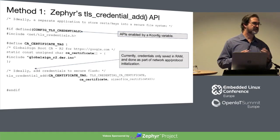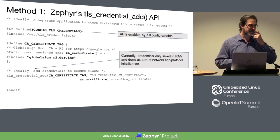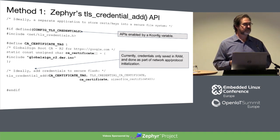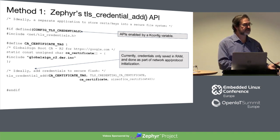Yeah. So that's a common concern, especially in the Linux community, for having this kind of offload in a mainline operating system like Linux. It's the same concern here, as you mentioned. There's a service pack, signed by TI, which can be updated for the device, that has new firmware for the network coprocessor. So if a new hack has been identified, TI can provide that. And through over-the-air updates, you can update the new image. It'll be signed also, so that you can update for any security bug fixes that might occur over time. But it would come from TI.